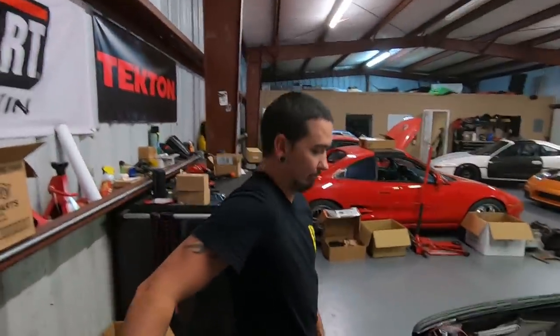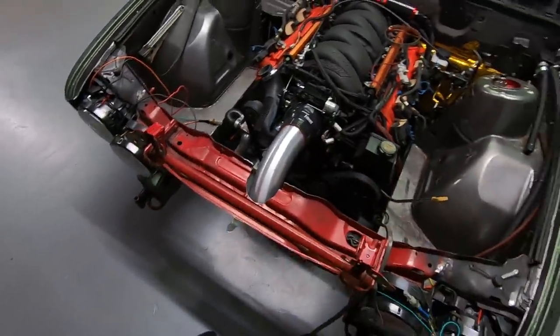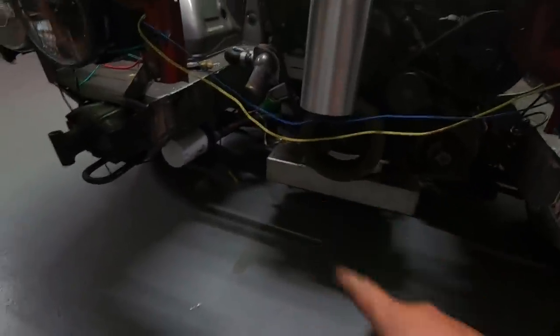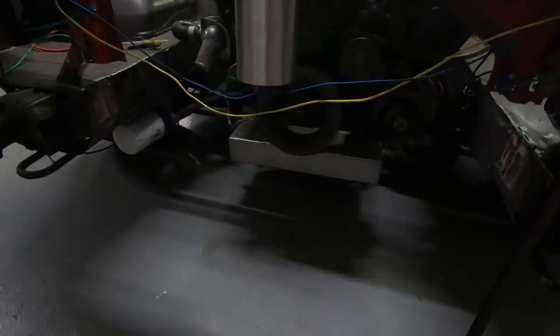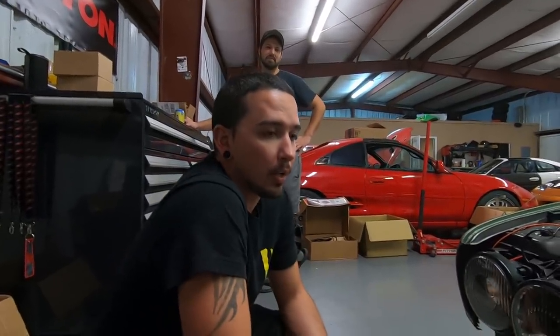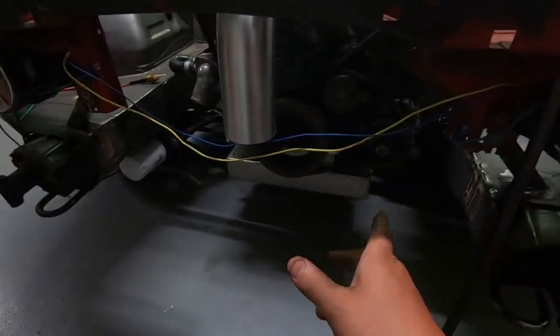So 24 hours in. We don't have much to show for it but we're making a little bit of progress. We cut a hole, we test fit this three-inch intercooler pipe, welded some supports in. We cut out a ton of the front of the car — this whole core support deal that came down and across here — to make more room for the intercooler. We got some new square stock going in there to replace that and tie both front frame rails back together, and also give us better mounting points for the radiator and intercooler. We're trying to tuck the radiator back and shift it down too.